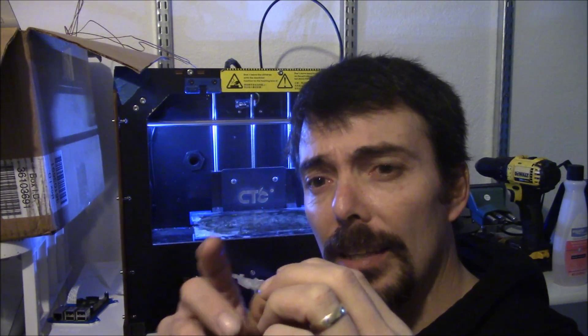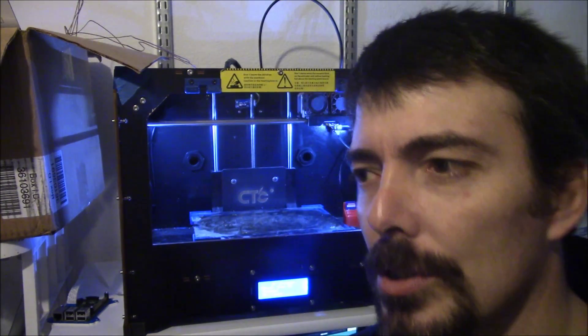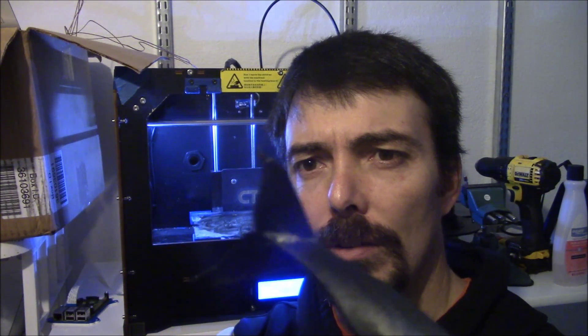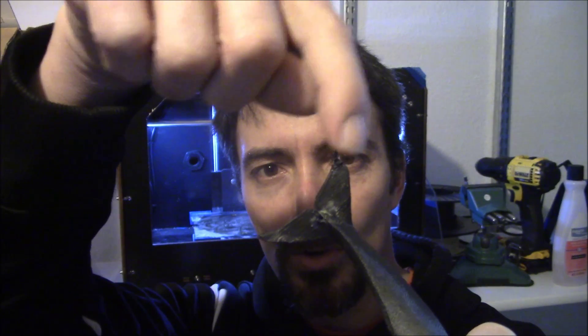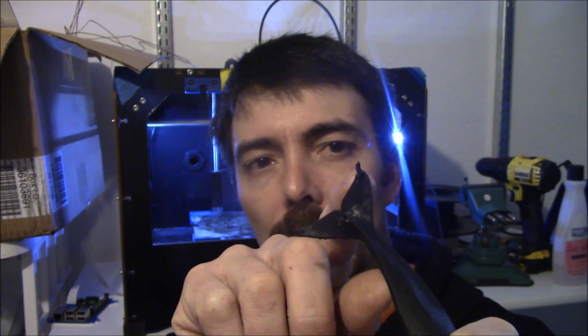Changing filament size is a way to control how much plastic is actually being put down on the build plate. The second thing I think is happening — I can't remember what it's called — is basically where your hot end is sitting right on top of your print. You can actually see it in the ABS prints. Right there on the tip of the tail, you can see where it's kind of warped. That happens because the print head is sitting there for a long period of time, going around and printing several layers right on top of each other in a very small confined area. It ends up heating up the actual print itself.